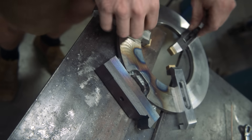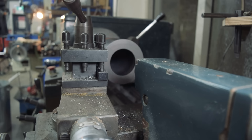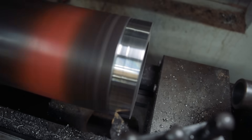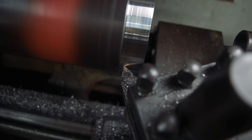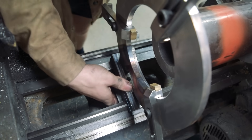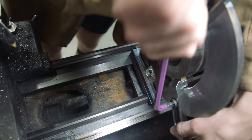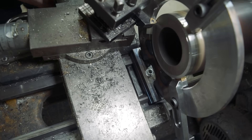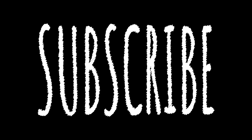To prevent putting too much heat into the bedways and so I could actually see what I was doing, I finished the welding off the lathe. Despite probably putting a bit too much heat in, it didn't seem like it had developed any distortion, so it was time to give it a test. Unfortunately this stock is the furthest thing from round so I had to turn a section for the steady rest to support — but it makes a great demonstration of why this thing is even necessary. And with the new steady rest — what a sight to behold. Now all I need is a real boring bar, maybe an ID lap and a tool post grinder, and I can't forget about strap clamps and probably a heat treating oven.